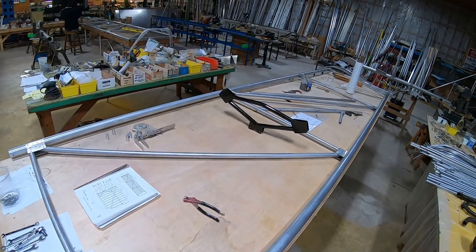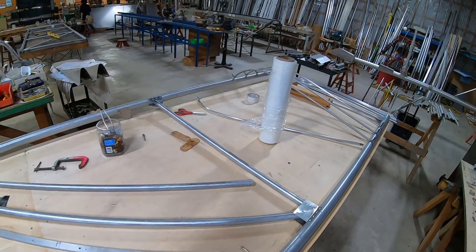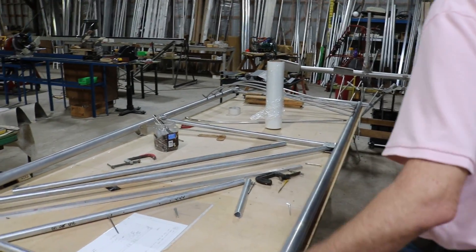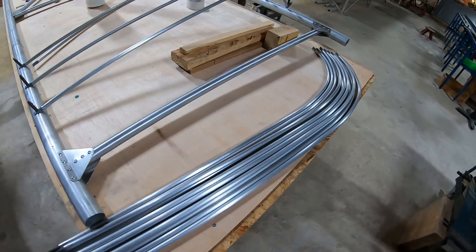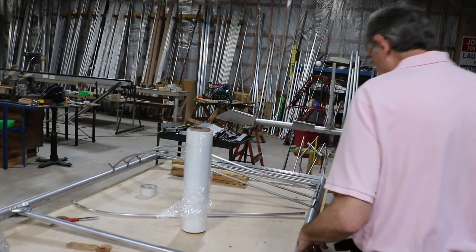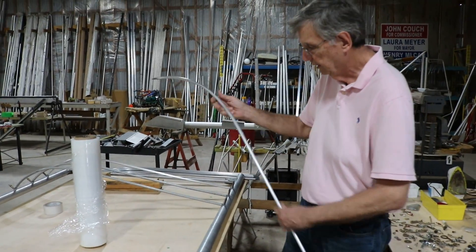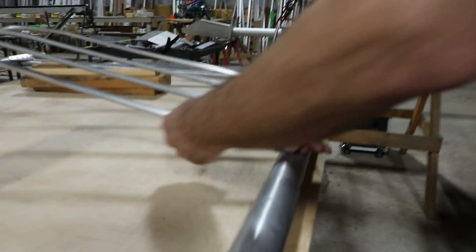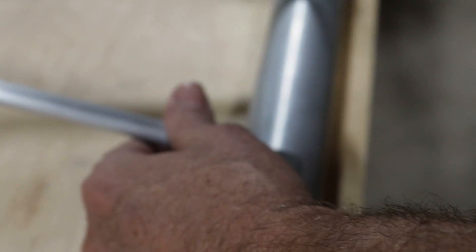The wing panels are pre-built for you. There are 168 AD64H rivets in this wing panel that create a Pratt truss. The SJ is beefed up more than the DR — this is a DR wing, so it doesn't have a Pratt truss in the last bay. The Chinook SJ has a Pratt truss in the last bay. The ribs are pre-bent, the nibs are attached, and all you're doing is matching the pre-drilled holes on your wing panel and riveting with stainless steel rivets.